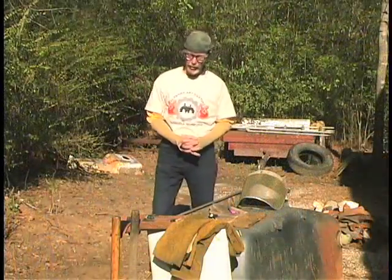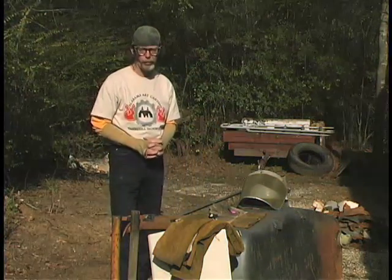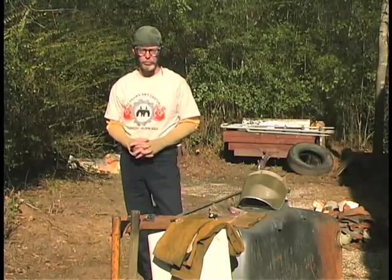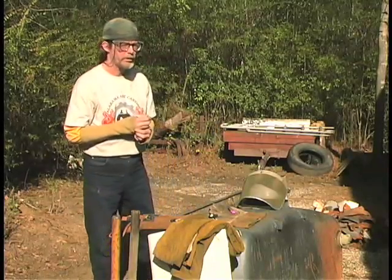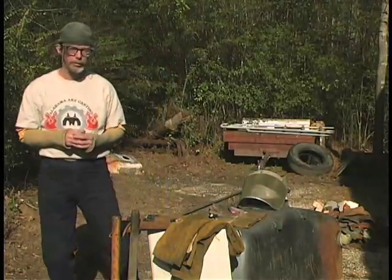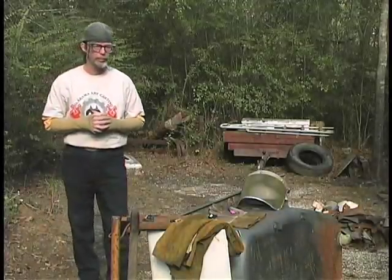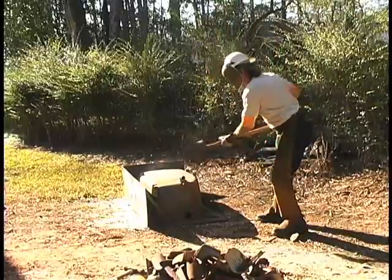There are many hazards associated with working with the casting of iron. It's quite obvious that being around a 2,500 degree Fahrenheit furnace carries its hazards of molten metal and possibly explosion. But it's deceptive how dangerous the breaking of iron can be. You are smashing away at very hard, brittle material with a sledgehammer. You think about a 20-pound sledgehammer slung by a 150-pound person even. There's many foot-pounds of energy that go into the breaking of iron.